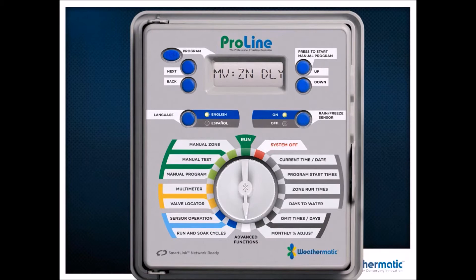Master valve zone delay is the way you handle water hammer and hydraulics. We use that a lot in Florida because we have iron in the water — we don't want that iron in our drip zones or on our house. So we run the turf zones with iron water because that water is less expensive, and then we'll put potable water around the house with drip and spray so we don't get that ugly brown stain on the house and we don't clog up our drip. If you put iron water in drip it'll clog it up — it's just no good at all.